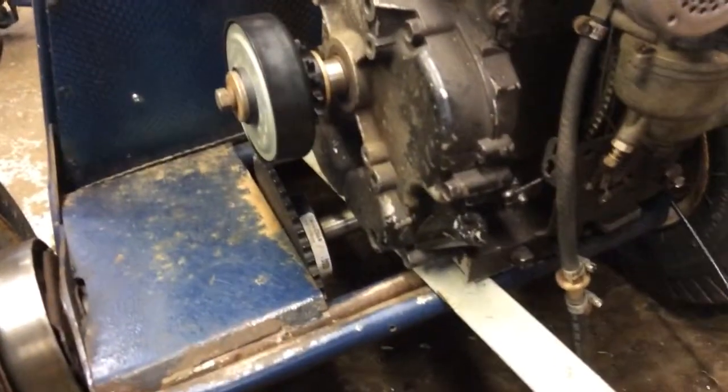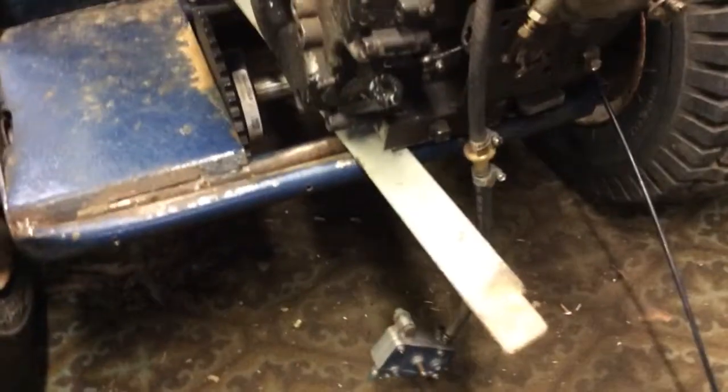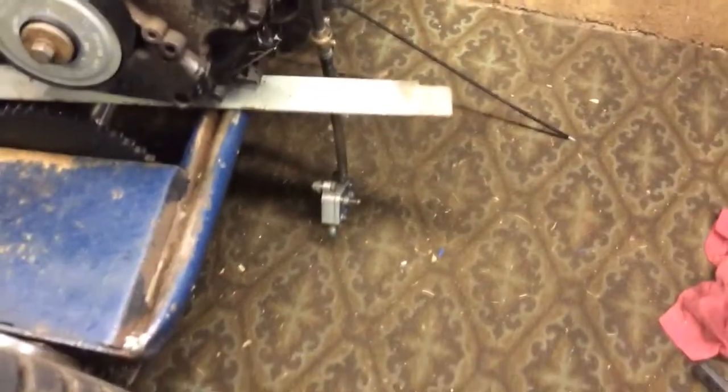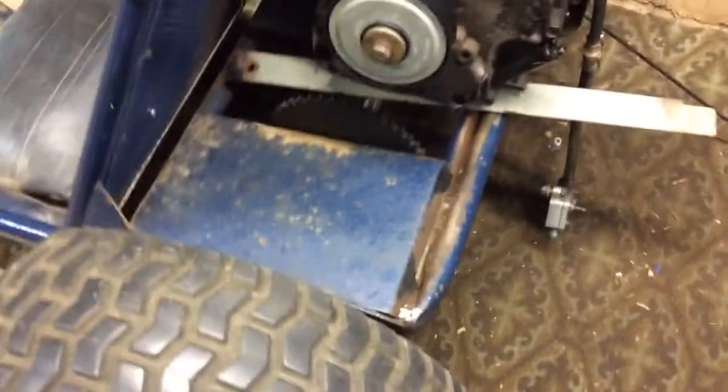probably do something a little bit different than most jack shafts. Have both be like idler sprockets, but they're welded together on a shaft, like on a bolt. So it would be kind of like this, but with a bearing in the middle. And we'd have 2 of them, obviously smaller size. So 17 to 45 to 17 to 45. That's what we'll be doing.